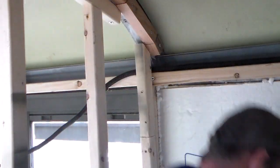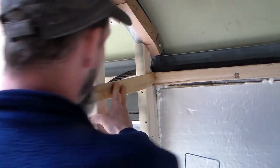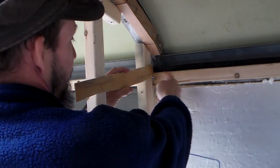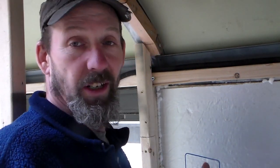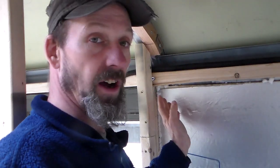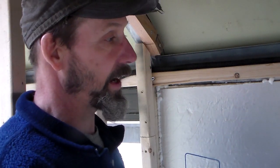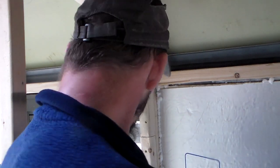So now we're faced with the problem that when you go to put the sheathing up with the plywood, you need something to nail to. I can't as easily just bend it around there unless it's going to be exposed in the closet, which isn't the worst thing. You have to figure out where you make the transition behind stuff that's covered up versus not. I could plywood this, but I need to drill a hole in the side of the bus to run the power supply through, and I haven't got the power supply yet, so I can't cover up those areas.